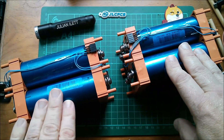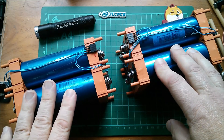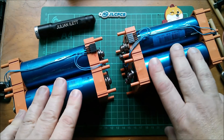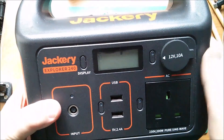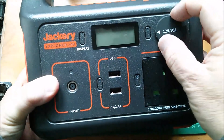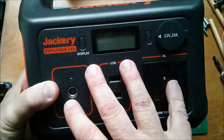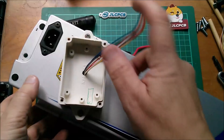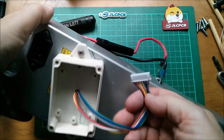This is not a very big battery — these are 10 amp-hour lithium iron phosphate cells, terminal voltage about 25 volts, so this is about 250 watt-hours. For comparison, this is the smallest of the Jackery power banks I've got — the 240 — which is 240 watt-hours, a similar capacity. I consider this to be pretty small from the point of view of trying to do crypto mining from stored energy.